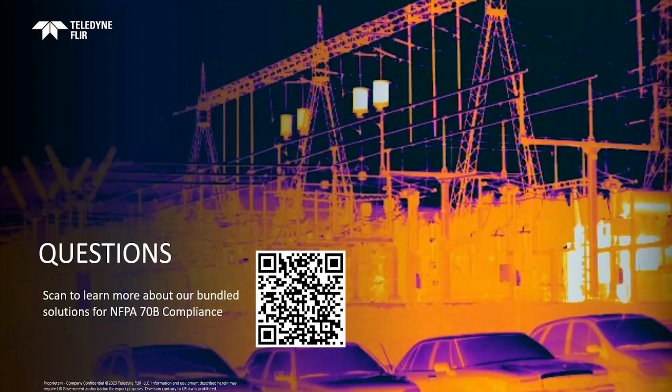So John, in the webinar, we talked about the need to document temperature differences and load readings. Can you maybe elaborate a little bit more on what's required with that? Yes. NFPA 70B recognizes that the best way for analysis of problems is to compare the temperature of an electrical component to either a similar component under a similar load, or compare it to the ambient air temperature.